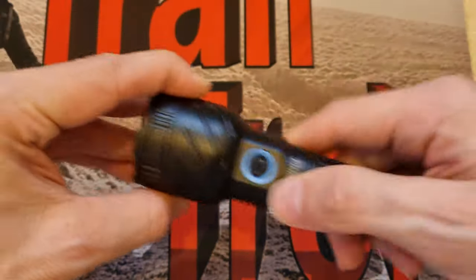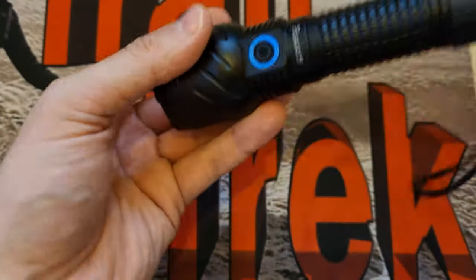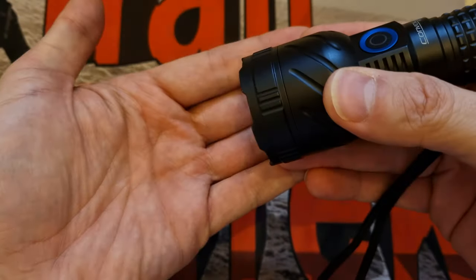There, it's ramping. Okay, so you also have a voltage check, which is five clicks. So one, two, three, four, five. So if you watch, what this will do is flash out the capacity of the battery here. So we'll wait until this starts again.